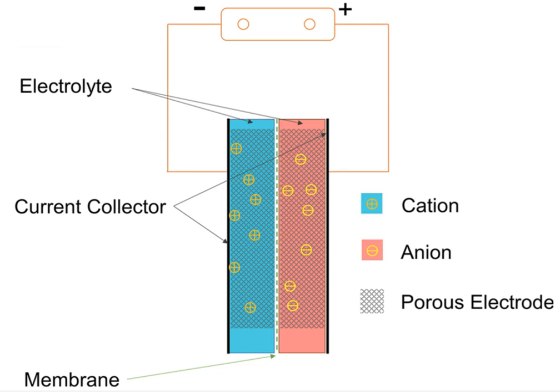Such long periods cannot be tested by manufacturers. Hence, they specify the expected capacitor lifetime at the maximum temperature and voltage conditions. The results are specified in datasheets using the notation tested time (hours), max temperature (°C), such as 5000 h, 65 °C. With this value and expressions derived from historical data, lifetimes can be estimated for lower temperature conditions.